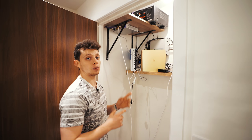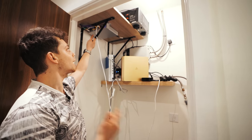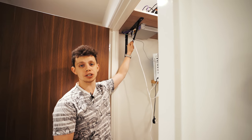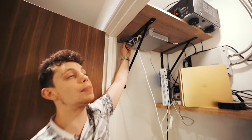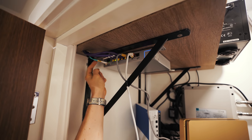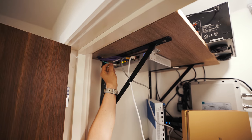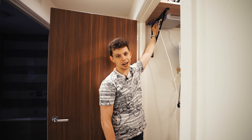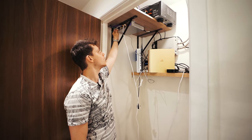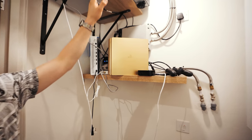All of that is tucked away in the loft, not taking up any space in cupboards. If I open this, this is one of my mini-switches — an eight-port UniFi switch, around 150 watts, so you can power different bits and bobs. Up here is a fiber optic cable which links between this switch and the main switch, providing the backhaul. This is actually a 10-gig fiber link to this switch, and the purple cables go out to all three of the access points. Eventually it will also run the PlayStations that go up to the amplifier for the TV in the master bedroom.